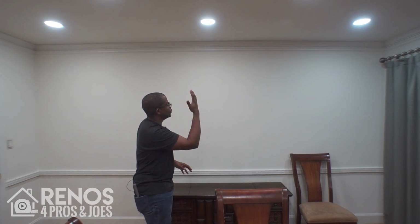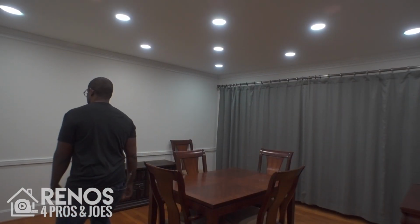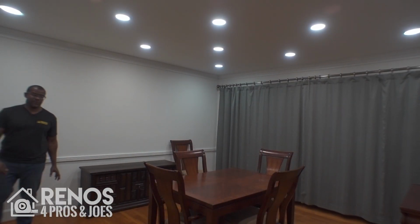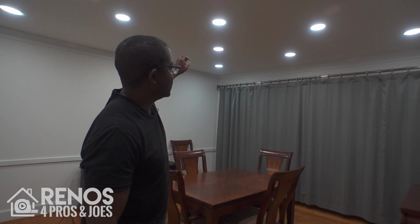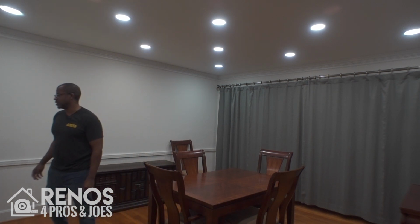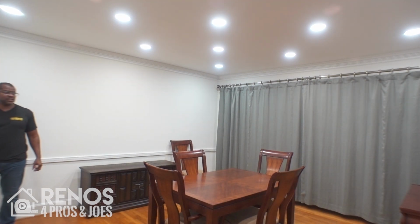And you can see that just from the overall illumination here along this wall, that this definitely has a more blue look to it. And it even casts a more blue color here against these greenish sage colored drapes. I know that the difference in color temperature is difficult to see when we have the camera positioned like this. You really can't see that fixture over there very well sticking out with that different color temperature, but as you get closer to it, you can see it a little bit more dramatically. Let's go ahead and push our illumination up to the maximum setting.